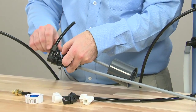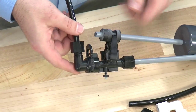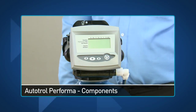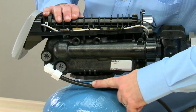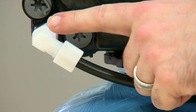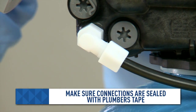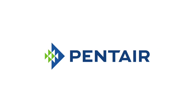We can reconnect all of our hose fittings, making sure that we snug up the connections as necessary with a wrench. On the Autotrol Performa Valve, we move to the side and follow our brine hose across. The connection here has a crush nut, so we want to make sure it is secure. The connection between this fitting and the body is one where we need to make sure we use a sealant, such as plumber's tape. Good luck, and thanks for watching.